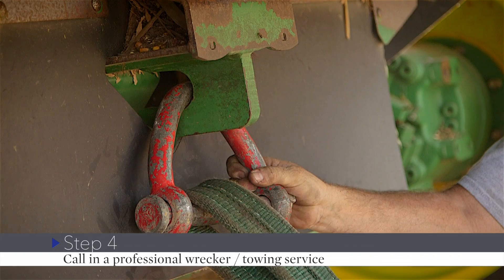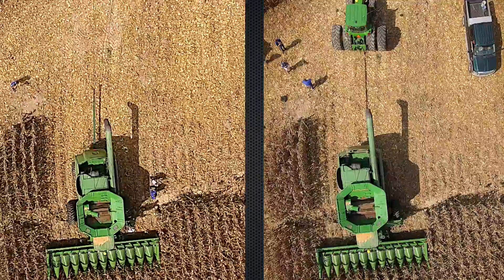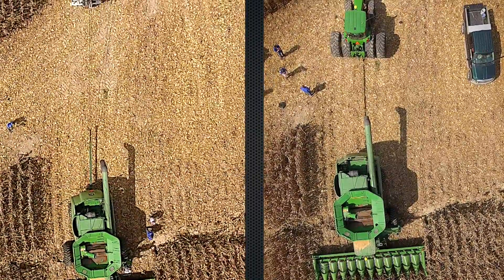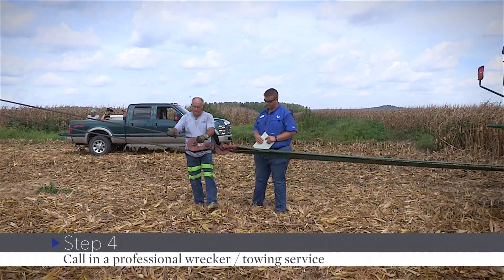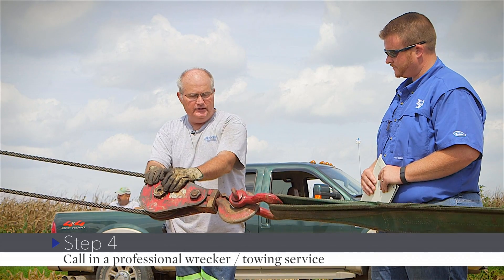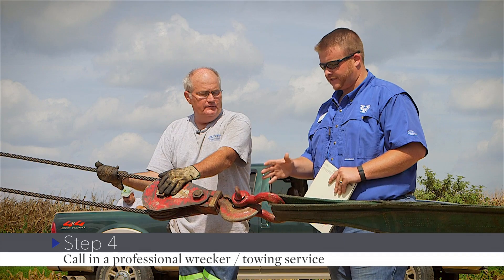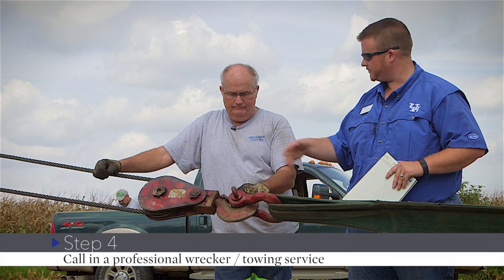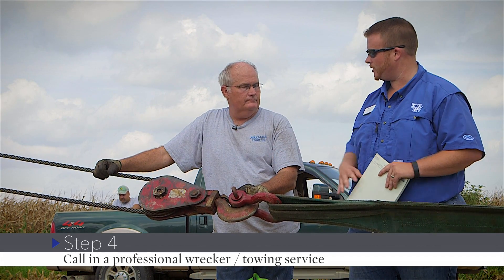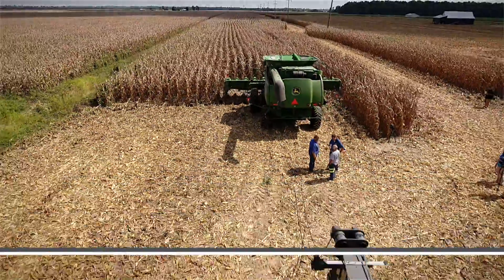Now using the same strap, we've got a shackle on the back of the combine and a shackle at the tow truck end, and we've doubled the strap. The key difference is the tow truck is now much farther away from the combine, so we don't have to worry about the combine coming into the back of the tractor. We've got a three-quarter inch, six-by-25 cable run through a snatch block, which increases pulling power by running two lines instead of one. Essentially, you've doubled the strength of your strap and doubled your pulling power using the block. We'll then engage the winches and pull the combine out. But before we do that, we want to highlight the four zones in regards to an operation like this.